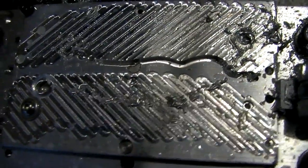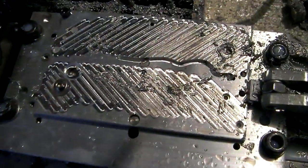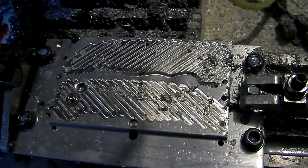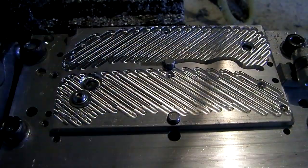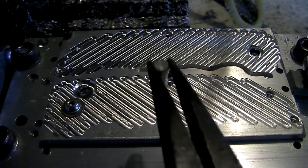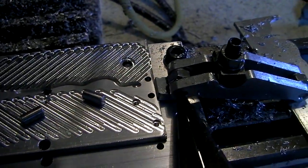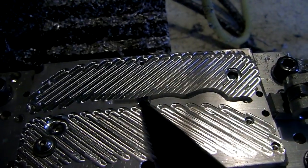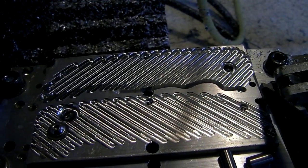It's going to happen to this one too. But it's 2 o'clock in the morning and my Knife Making Tuesday is over. I'm almost done with this though — just going to profile both sides and corner around them. So I'll deal with that tomorrow. I have to finish it now that it's on the machine. So I'll finish that up on Wednesday. Alright, so it's Wednesday now. Had a good night's sleep. What I'm going to do to fix this problem is use longer pins and simply pull them out after it's been clamped down — clamped here, here in the corner, and here with the finger clamp. So I don't need the pins anymore, and now I'll be able to profile around the outside without hitting them.